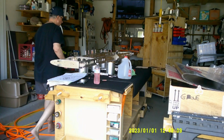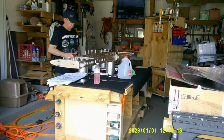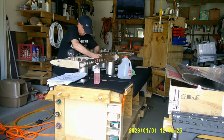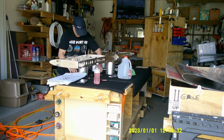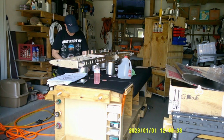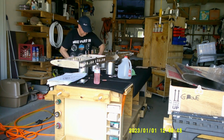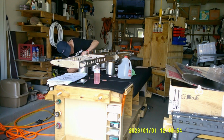So here's further on. I'm shooting. I've started piecing the ribs back into this again, and like I said earlier, you build this thing at least 3 times. So the two horizontal pieces are fully riveted, and now I'm putting in the Clecos in all the ribs and the trailing and leading edge round pieces and, what do you call them? The pieces in the back. I forget what you call them. But I'm getting them all aligned and Clecoed in, and you'll see me here soon actually riveting all of these ribs into place, and that's another whole good feeling.